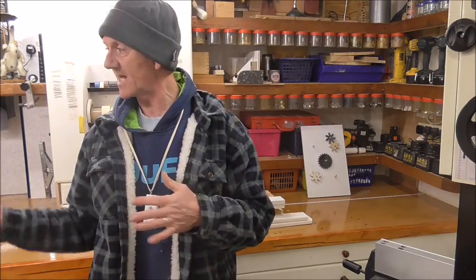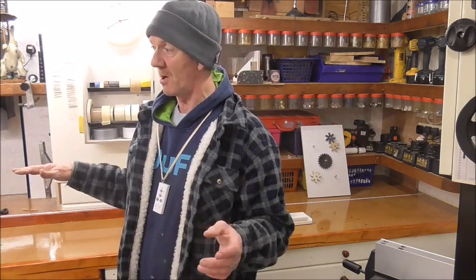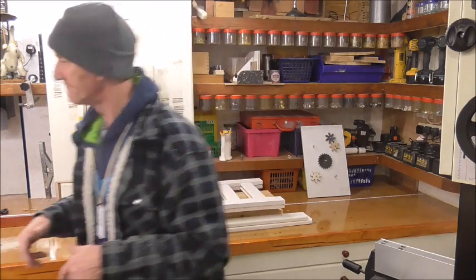Okay, so that's all the pieces for the depth of the bed that need adjusted. Now, adjust a few of the screw holes and such, and I can reassemble that bed and just make sure everything's okay. Before I do that, what I want to do now is take the posts off all of them and chop them off so that the 2 bottom ones are level and the 2 top ones have that pitch coming down to allow for the new legs that are going on. So I can get that straight down here.